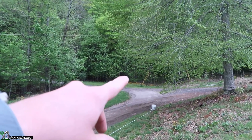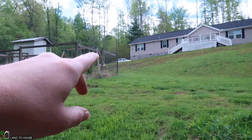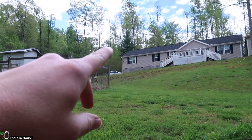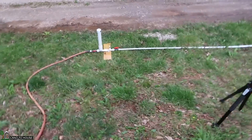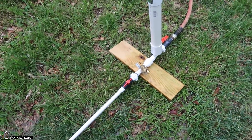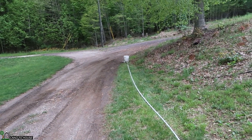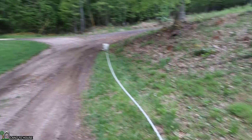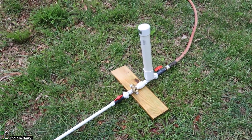My pump down in the creek over here has 7 foot of head pressure and is pumping about a quarter gallon a minute past the house up here on the hill. So having the check valve totally upright makes an enormous difference in the efficiency of the pump. In a minute, whenever this is done, I will actually lift up our bucket to another foot and we will see what it's like to have closer to 3 feet of head pressure. And we'll be able to tilt the valve up and you'll see the difference in the output.